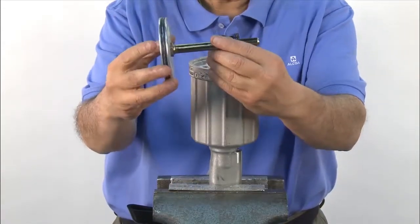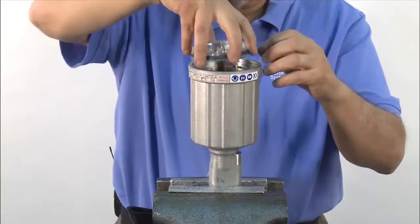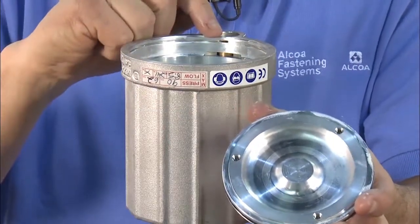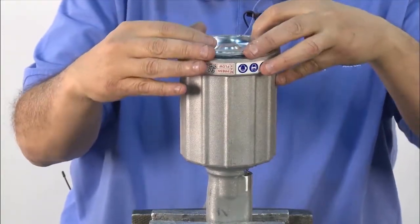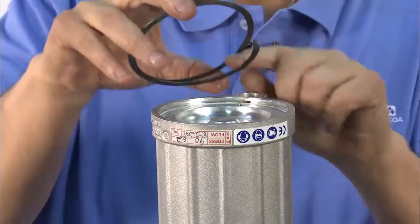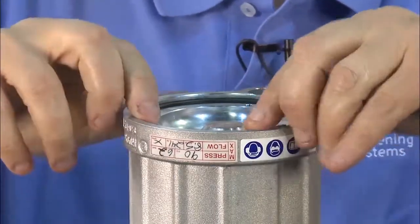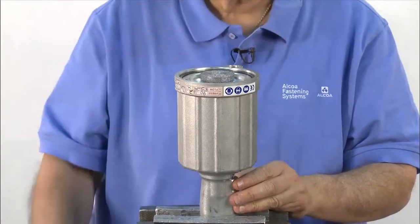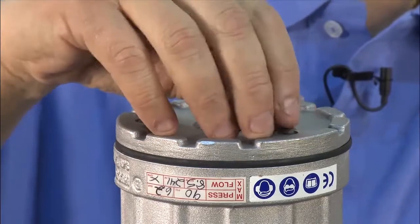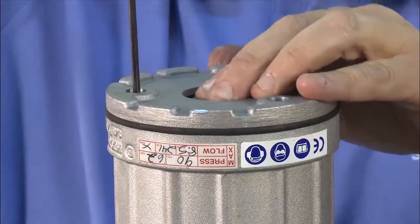At this point, bring the air piston rod in. Lightly lubricate the piston rod and seals, then push the rod in. Install the back cap, lining up one of the holes with the indicated spot. Use the brass hammer to make sure it is bottomed out. Take the spiral lock ring and walk it into the groove, being extra careful to ensure it's properly installed. Insert the muffler and back cap with the rubber gasket and insert the screws using an Allen wrench. Manipulate the muffler to ensure proper alignment in the back cap.